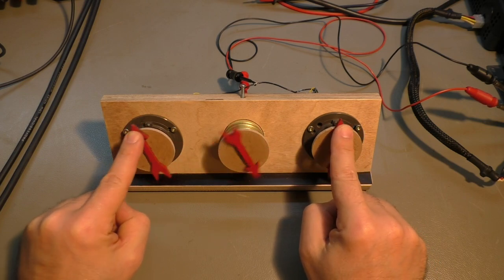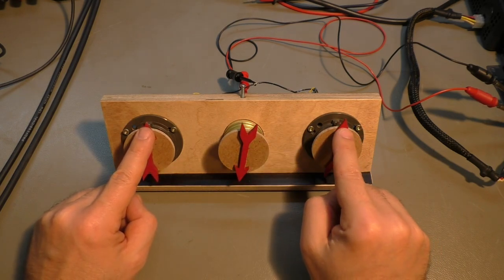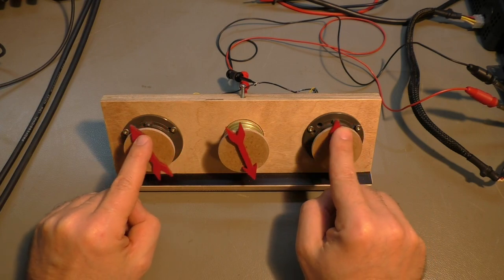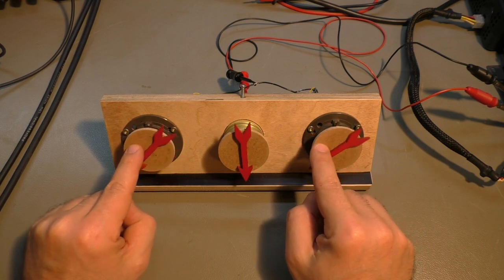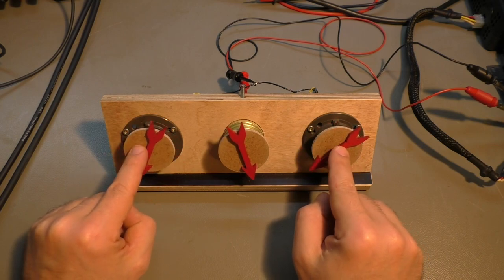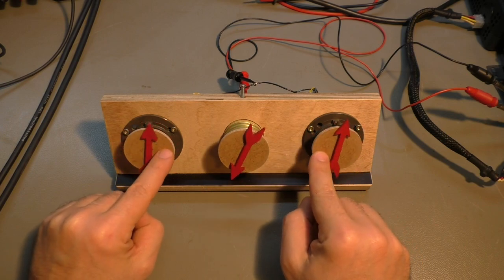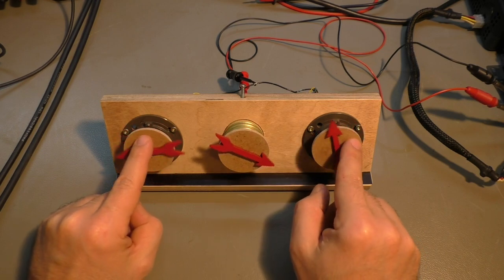So we can add the angles here on the differential synchro. Now this is exactly what happens in the propeller synchronizer box. We have two engines that are compared with one differential synchro. When the two engines have the same speed, nothing happens here.